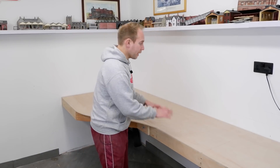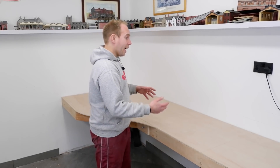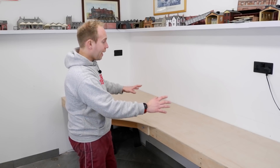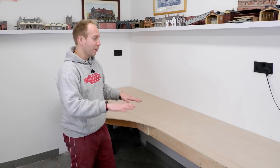There are two reasons I've broken this into three different boards. First, as a single board it would just be far too heavy to move. And secondly, if we ever decide to move house, it would be good to be able to break it down into manageable chunks that can be packaged up and moved separately. I've gone for a closed box frame design because vertical height is important to me — with an L girder it would be significantly deeper. And it doesn't need to be super strong because the majority of the weight can be held by the wall.